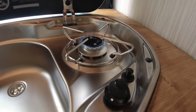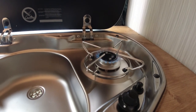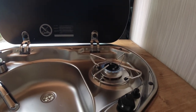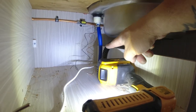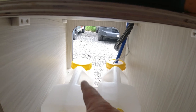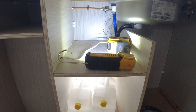All I've got to do is secure the worktop now. Once I've secured the worktop I'm going to give the gas system another spray with soapy water just to double-check, treble-check. Now I'm going to secure the worktop and work on the water side. As you can see, the water pipe is now connected, and so is the waste pipe. All the gas is hooked up - all I've got to do now is drop the waste in and then it's down to wiring, but that's a much later date.